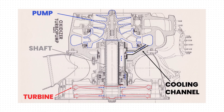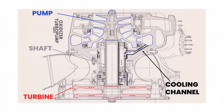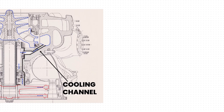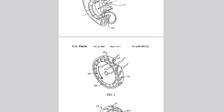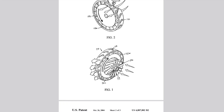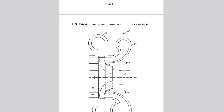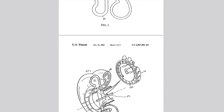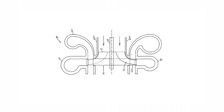Now that we have thought through how conventional methods from turbofan engines might be applied and seen why they would fail in rocket engines, the next question becomes: what other solutions could be thought of to have active turbine blade cooling in rocket engines? In the process of researching this topic, I stumbled upon a US patent which developed a new kind of turbine-pump combination. This concept might solve the problem of circulating cooling fluid through turbine blades and make rocket engines way more efficient. I will try to explain it first in this 2D figure with animated flow paths.